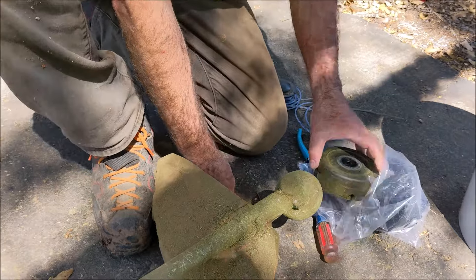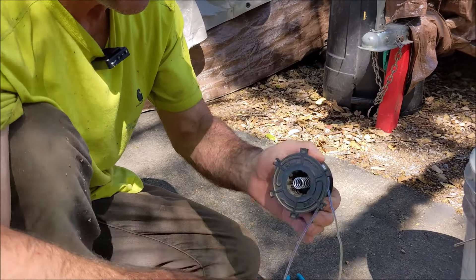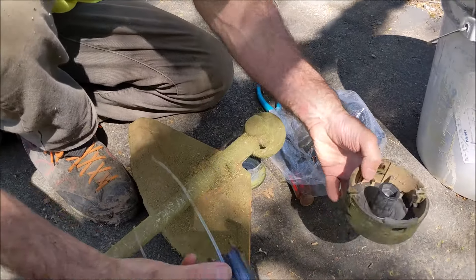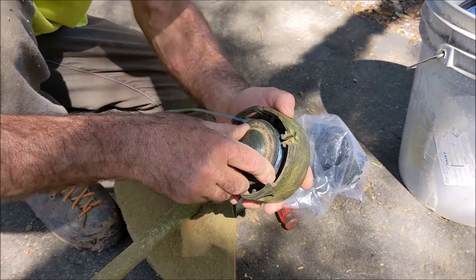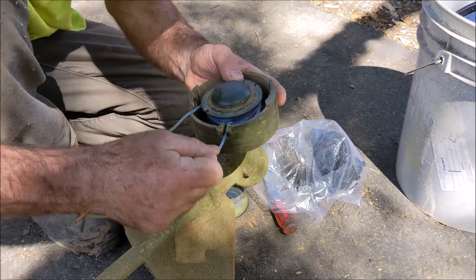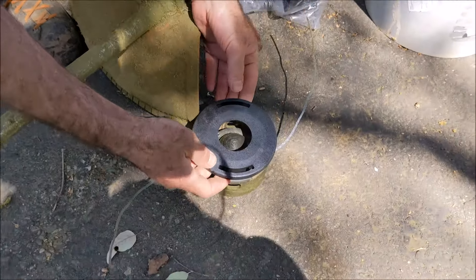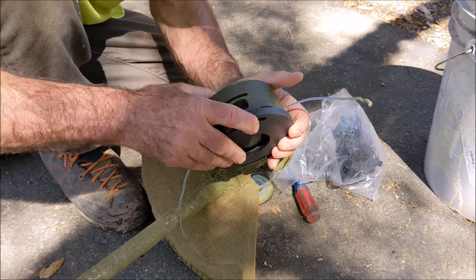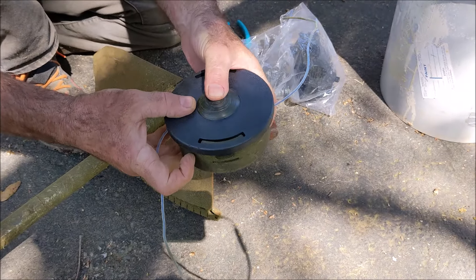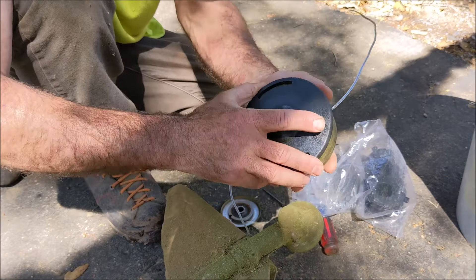There's that metal plate, and then you can just replace the whole head. I love Stihl tools and I always buy Stihl and support my local dealer, and I'd recommend OEM parts, but this is one place I actually just go on Amazon for replacement parts because I wear them out so fast. That nose piece just clips in underneath there, the line goes through that eyelet and this line through that eyelet, then there's that new face. It locks on nice and solid, then we pull that string out from underneath — that's when the bump nose comes out and it'll bump out. You certainly don't have to take the head off to replace the face or the nose; just roll the head over.